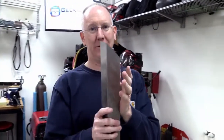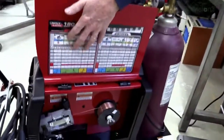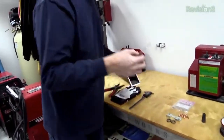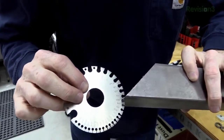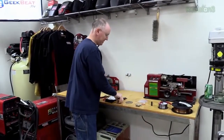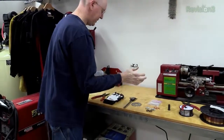When we're welding, let's say we want to weld this piece of material. One really important thing is we open up the side of our welder and we have this beautiful chart that tells us what the settings should be for speed and power, but it's all based on the type of material and the thickness. You can't set it up if you don't know the thickness. So you can use one of two tools. They make these little circular ring sizers with all these gaps — you slide it over the edge of the material until you get the one that just fits. Then you know — for example, this is .070 thickness or 15 gauge. You can then go back and set it up on the chart. If you want something that works on different material types, you can also get digital calipers and just measure it. They're both pretty cheap.